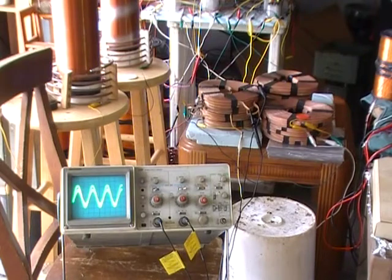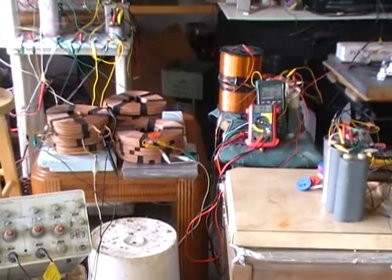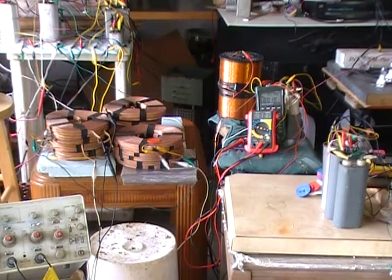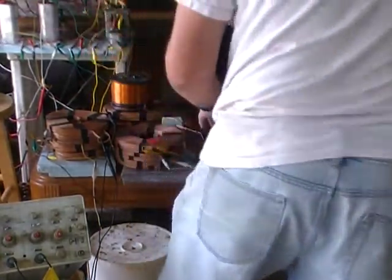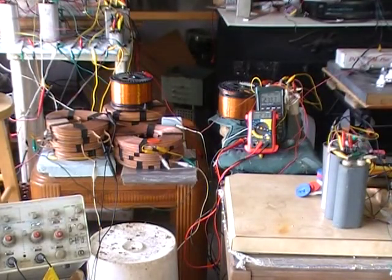Now, having dismissed all that, we're going to look at the inductor, secondary inductor. It's off to the side in space. We're going to put that inductor on one of the phases. We can put it right over the scoping, as a matter of fact. We're now pulling 218 volts from that top coil in resonance, 28 some milliamps.